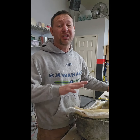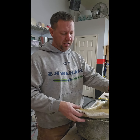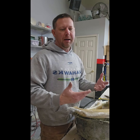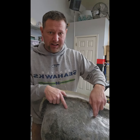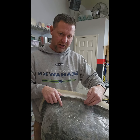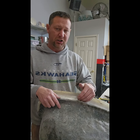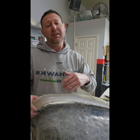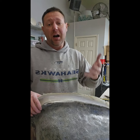After three layers of fiberglass and letting it dry, you have to de-mold it, which is probably the hardest part of this whole thing. When we build from the master design, we actually add extra material — the actual tank shroud only needs to go about here, but we add a little extra and a lip so you have a place to de-mold from.